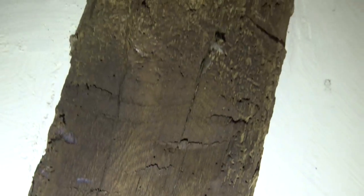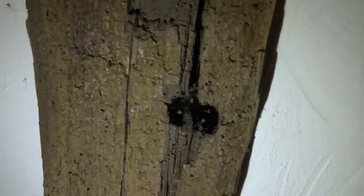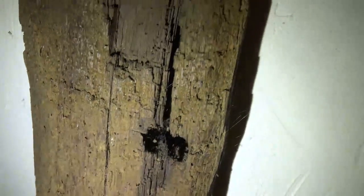So we've got an elm beam, but what we've also got above it is an oak beam. If you look at that oak you'll see much coarser grain up there — very coarse. Again you've got beetle on the outside on the sapwood, and you can see here it's almost like a round pole and the beetle are just underneath the bark on that round pole. You'll see all these little beetle holes — these were under the bark when the tree was felled and they left fairly quickly afterwards.